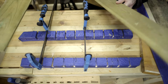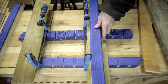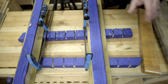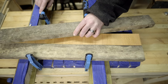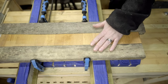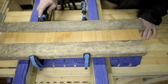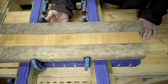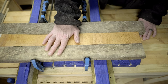We're still a little bit shy, but no worries — super easy fix. Get a couple of pieces of wood to use as shims, stick those in there, the wood goes over the top like so. You can put another one of these stretchers across the middle if it's a particularly large board. Then stick the wood you want to clamp up in between the two, just like so, and tighten it up. We've got a gap under there which helps with drying and it's not going to get stuck to anything.